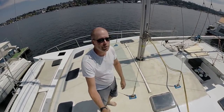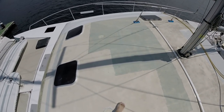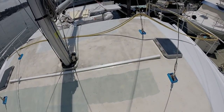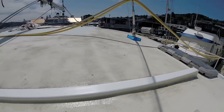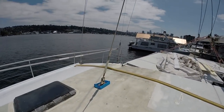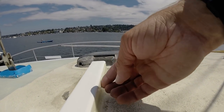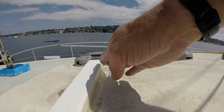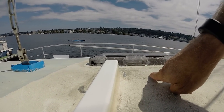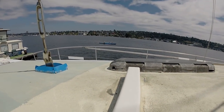I've got quite a bit to do here. I do one skim coat, then I'll sand it and do another. The traveler is starting to take shape too — I've got it epoxied in place. Next I'll shape it with fairing compound. Now that the epoxy is starting to fire off, I'll let it harden for one day, then shape it with fairing compound. Then I'll lay glass cloth about three inches out, up, over, and three inches out, then fair that in. It'll be nice and strong.